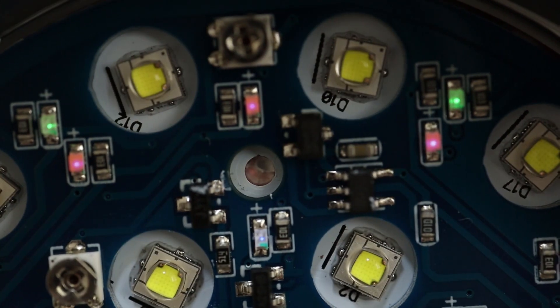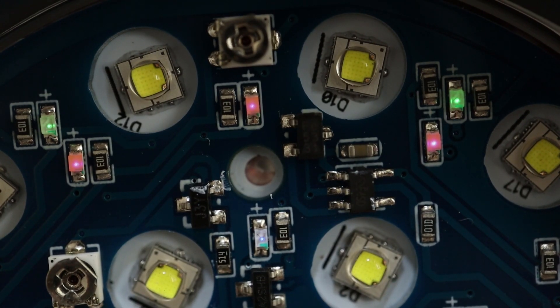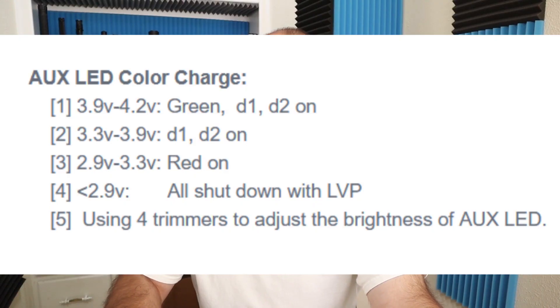One last thing: we also got color LEDs in this one. Several beautiful LEDs that are not really bright enough to use for light — they're not high power — but they are very attractive and they do have a function. You can use them as battery indicators. What these little LEDs display will change as the power of your battery goes down. This chart shows what they mean, and I like that they put it as the voltage of one cell and not the whole pack voltage.